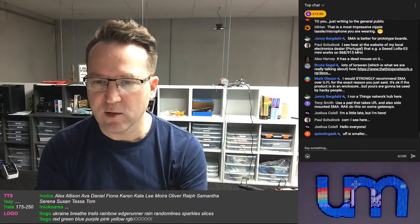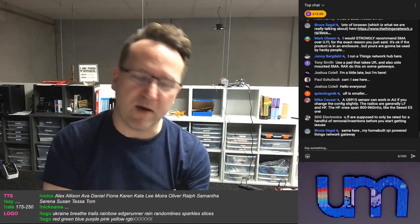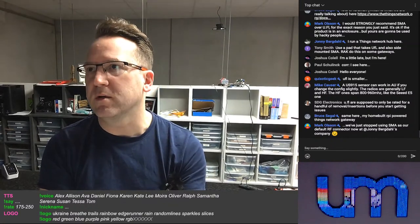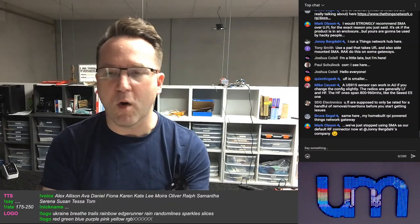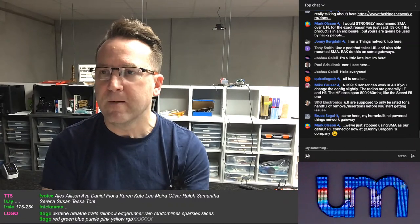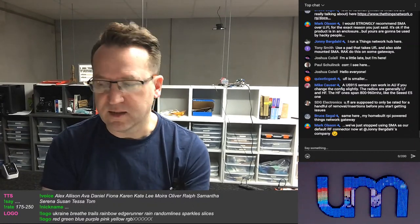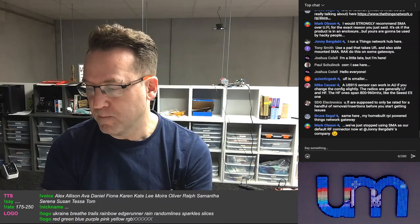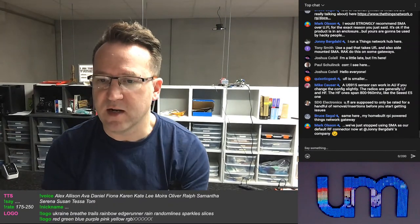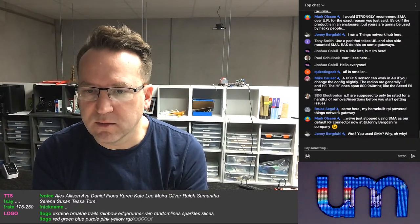Oh, Exotic Geek, hello. Yeah, UFL is smaller, but it's also got fewer mating cycles. It's more fragile, easy to damage. So I was curious to know why you'd put an antenna on and then regularly take it off and move it around. He said he regularly takes his antennas off and moves them around, and I didn't understand why you would do that. Obviously, it's much smaller, and you can get smaller external antennas. We just stopped using SMA as our default RF connector now.